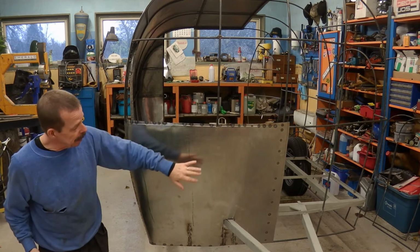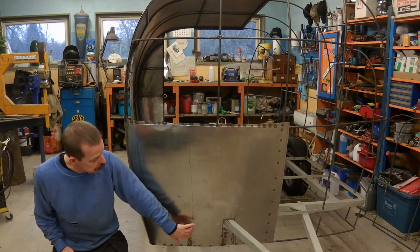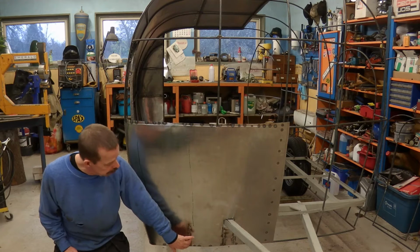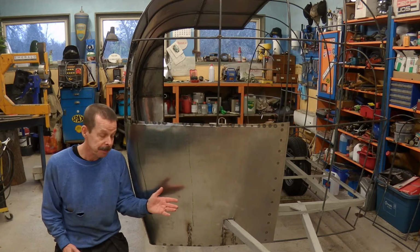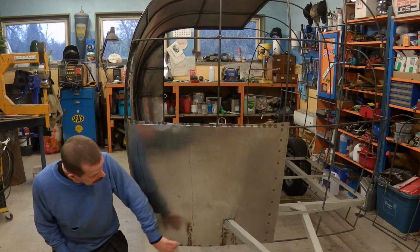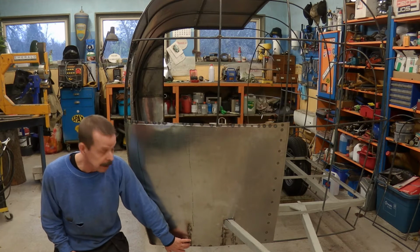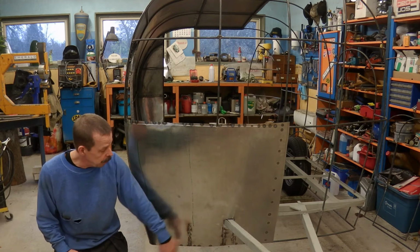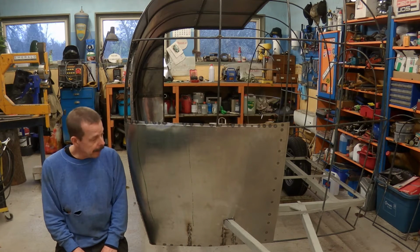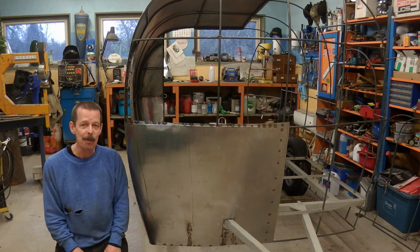well. So in the end, when I pushed it in place and welded it in place, it was still a little too wide here. It should have been a bit more shrunk. So since I welded it in, once again, filler is going to be my savior. I just made a slit, which amazingly enough, I didn't have to take any material out apart from actually just making the cut. And then I could just push it in and weld it. So that's why it's looking like that. And it's looking okay, but I hope not all of the panels give me the same kind of struggle.